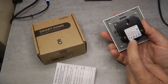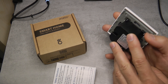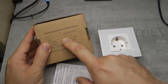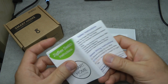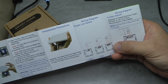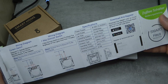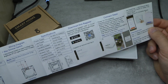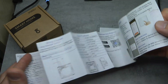I'm not seeing any certification here - no TUV or European certification. There is a CE-style logo but that's the China export mark, not the European CE. There's also an FCC logo but nothing else. The box looks quite generic - the current rating even shows 10, 13, and 16 amps. The instructions come in German and English but are also very generic; for example, the wiring diagram shows switch wiring rather than socket wiring, and it states 1000 watts per gang which is definitely not correct for 16 amps - there seems to be a mix-up in the documentation.